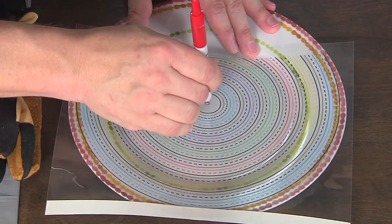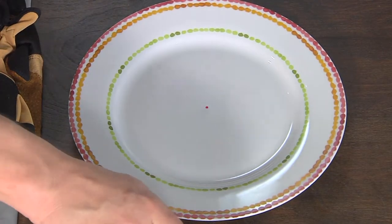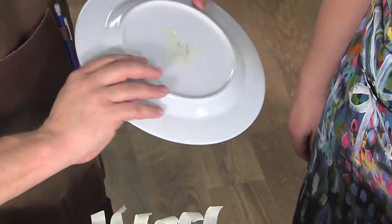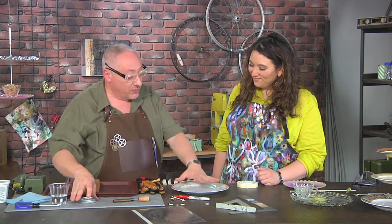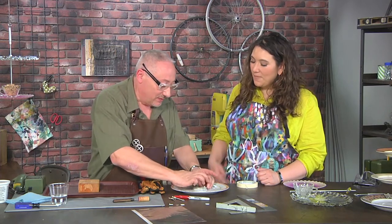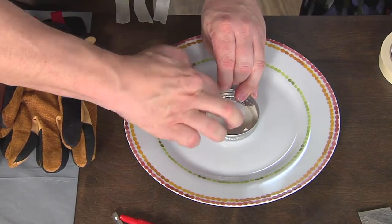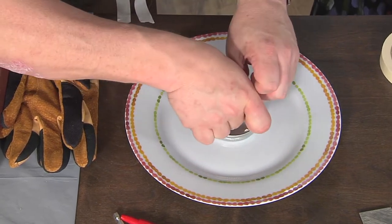Use a permanent marker just to make a dot. It has to be waterproof because we're gonna drill this with water and we don't want it to wash away. The other thing is to put an X on the back — that'll help when the drill bit breaks through to not break the other side. We're gonna use a wet drill approach. Here's a trick to make a little swimming pool: use a mason jar lid and masking tape to secure it down so that the water stays in that little area. And if the water gets out, no big deal because we're gonna drill on top of a tray.